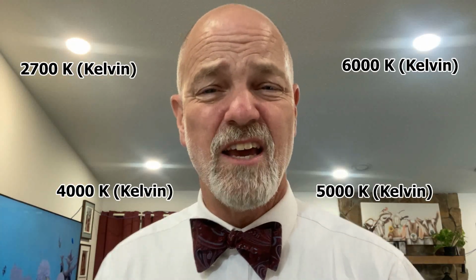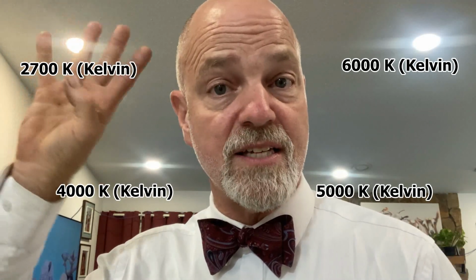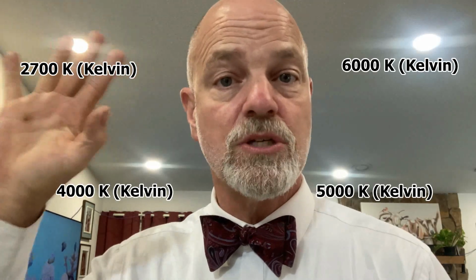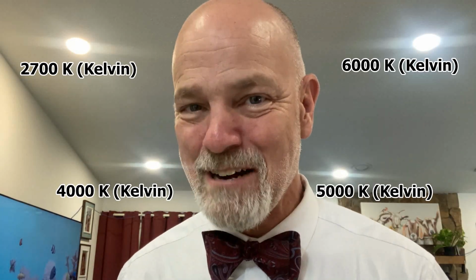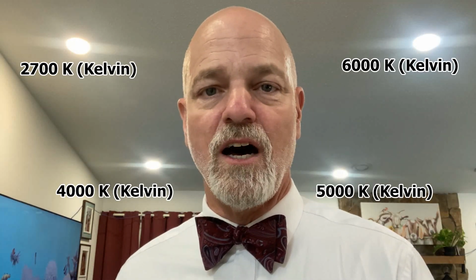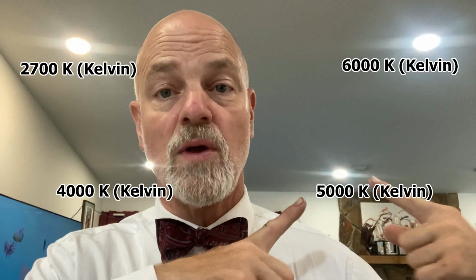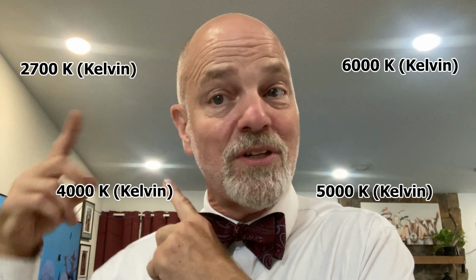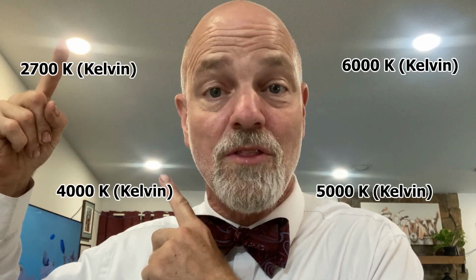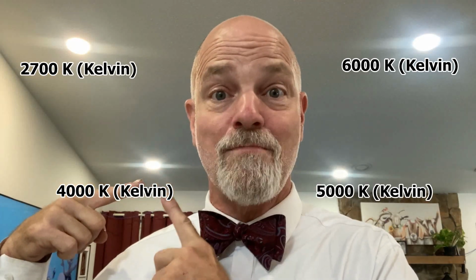Now, this is very common. In fact, I was doing some research, doing the sanctuary at our church building and redesigning the lighting, and it had a lot of this very lighting in it because the guy who put it in, that's what he's used to. He goes into his home, that's what he has a lot of. But the problem is, because we live in Florida, there's a lot of retired people, we have a little bit higher population of older people. And so when I designed the lighting, I actually went to this lighting right here, the 4,000 Kelvin, because the older you get, the less yellow you can see. I didn't change the brightness at all. I just changed the temperature, and suddenly everybody could see better.